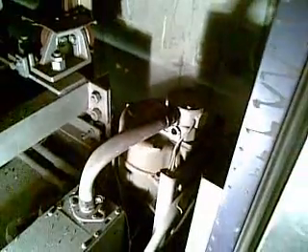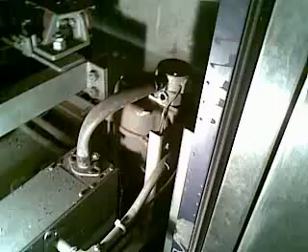What we're looking at here is the lift in between floors, and we have a door operator which consists of a motor pointing downwards. When this motor spins it turns a cog at the bottom, then it turns a sprocket which drives a chain and runs the door operator. The chain runs a sprocket and moves the doors.